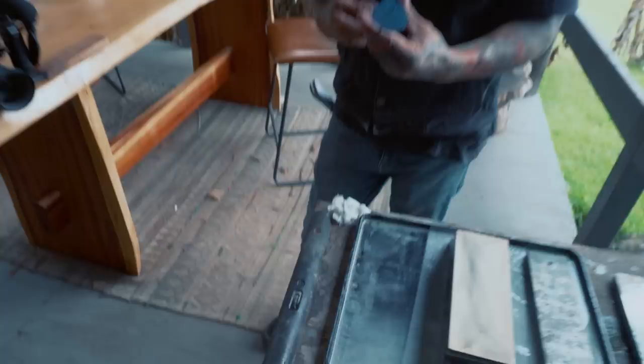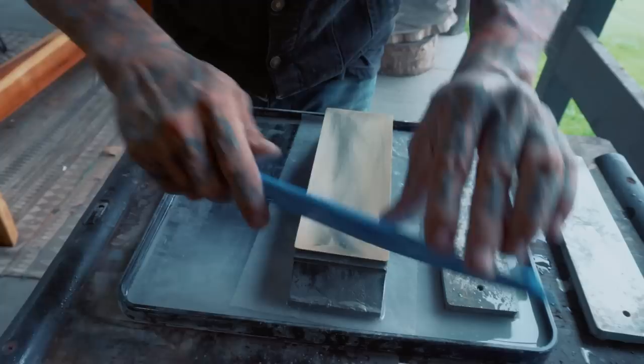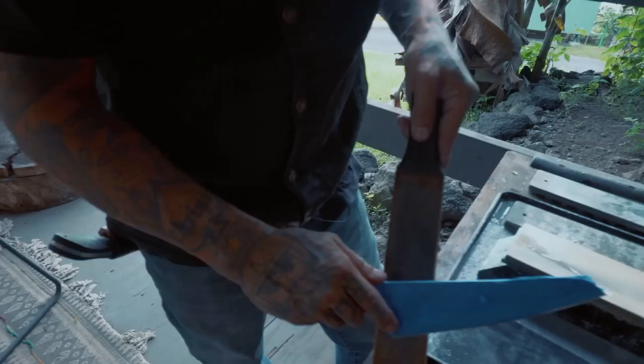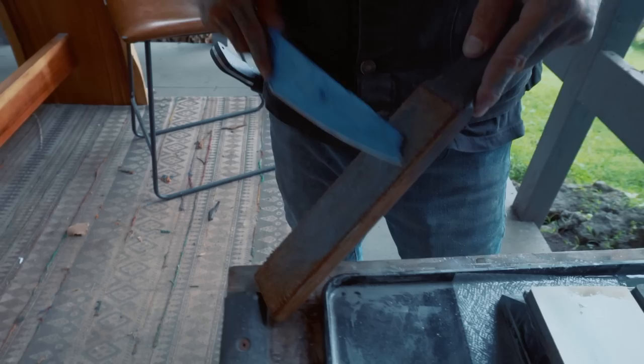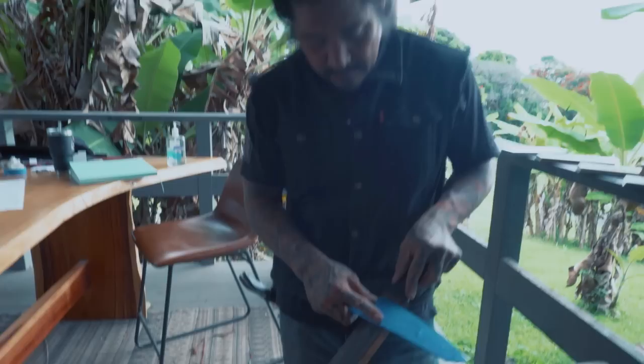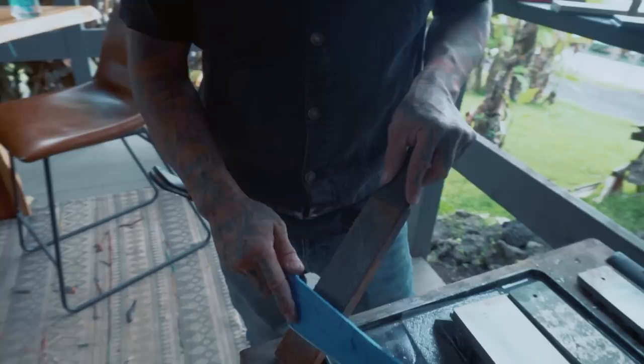For a skinning knife or hunting knife I leave it at 220 because it's really micro-serrated and can cut through hair, skin, and tendons. But for a standard chef knife I like to go up to 3k and then come back and do a couple final strops on the 1000. Clean off all the burrs. The 3000 gets all the rubbish off and leaves it very clean, then light strops on the leather strop to knock off anything else.